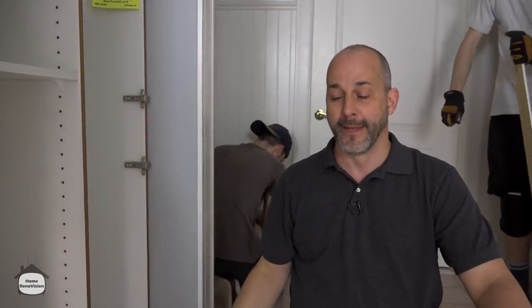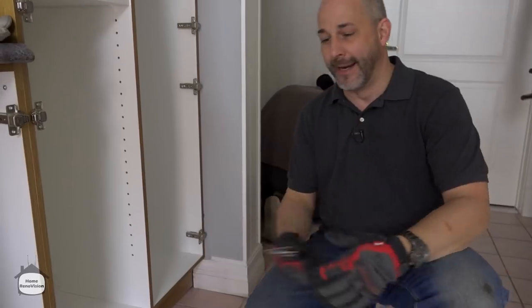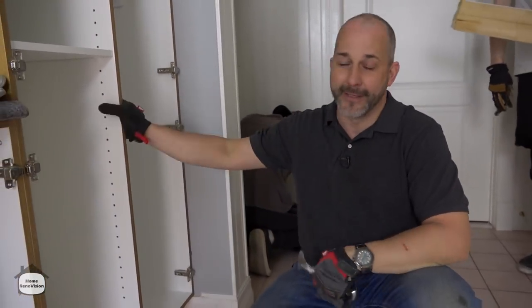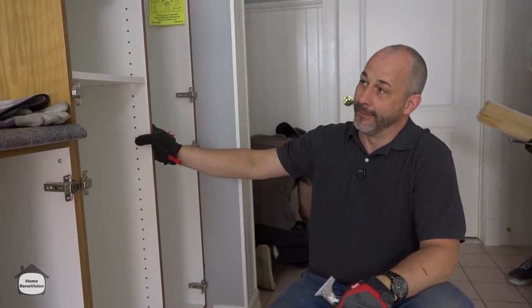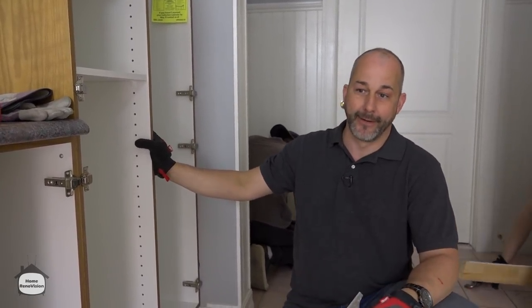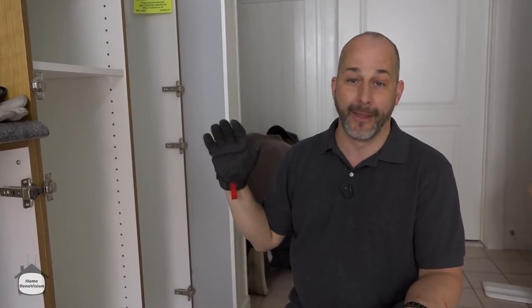In this case all of these cabinets are sitting on a finished floor, which can present a bit of a challenge. We're going to remove this tile up to the toe kick, then cut the subfloors all the way down and leave all these cabinets installed. We don't want to increase the scope of work and remove the cabinets — it's not going to be necessary. If anybody ever wants to change the cabinets and flooring again in the future, they can be my guest.